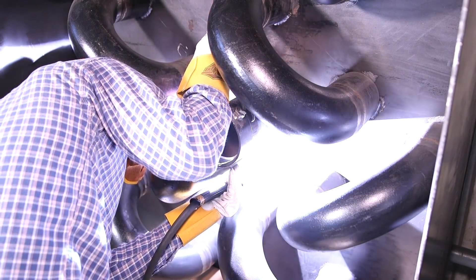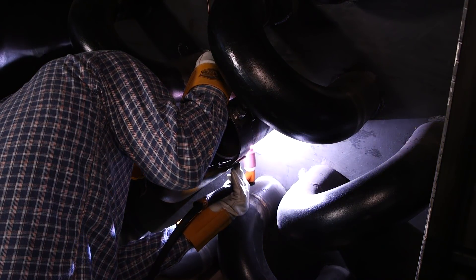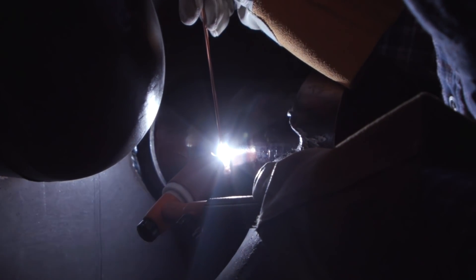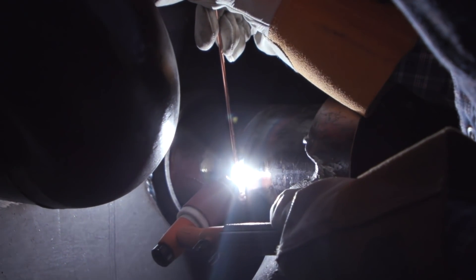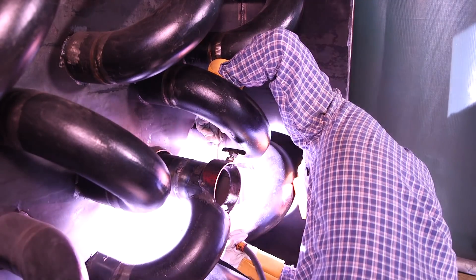On the cap, if the pipe gets too hot, you can always just lower down your amps — I'm going to lower it down to 140. Before you tackle anything, I always look at it and try to see where I can fit my head and how I can position my body. That way I can be more comfortable, because I'm not going to start welding if I'm going to get a cramp. I always make sure I can move my hand, move my wrist, and make sure I can look at the root or both walls at least. You never want to go into something putting yourself in a bind. I've seen guys get cramps and it's funny, but at the same time it's not, because you can mess something up and lose your job.